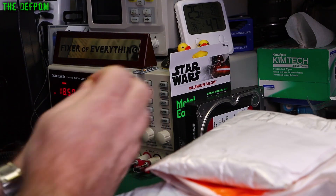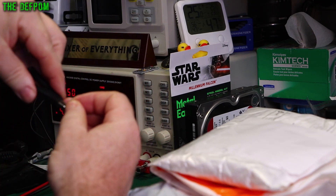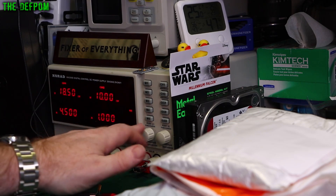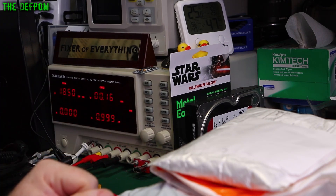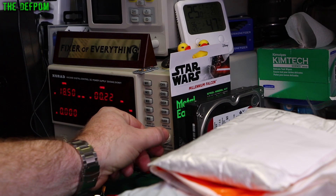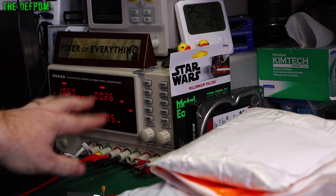These are rated at 30 volts, I think. I'll drop this down — I don't want to use too much power, I'll just do 10 volts. What I'm going to do is hook this across the actual output of the power supply — just across there. We'll turn the power supply on. So you can see I'm running 10 volts at 1 amp. This will provide constant current — the voltage will collapse and it will set a constant current. This is a 900mA PTC, so it's going to sit there at 1 amp for many hours I expect. You can see it's collapsed the voltage — that's 170 millivolts. Let's wind the current up a bit — 1.5 amps. You can see the voltage has crept up slightly, because the resistance is causing a drop across the actual PTC, and you can see it's still kind of handling it.